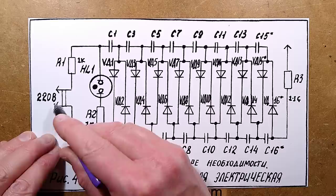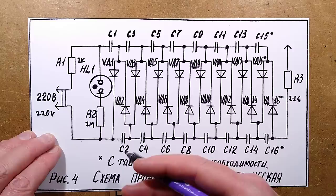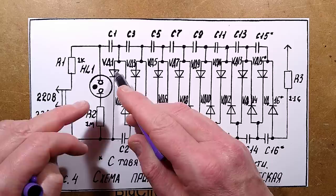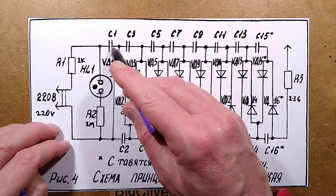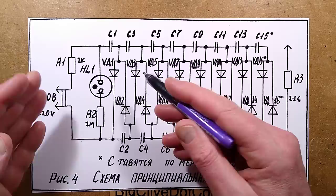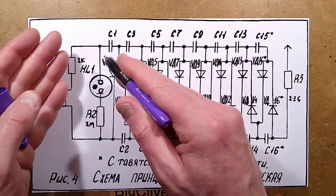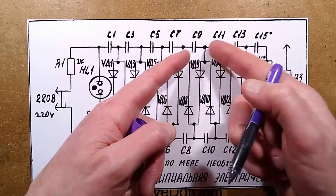So here's 220V — that means 220 volt. It does also mention it can be around 120 volt if they use a non-isolated autotransformer, so I wonder if there are multiple voltages in Russia. Fundamentally, that's the alternate push and pull of the mains — the AC. The current is steered via the diodes and it increases by one step each time. It won't double the voltage each capacitor — it adds the value of one capacitor to the next. Say for instance it was 600 volts across them once doubled — it would end up like 1,200 above the next capacitor, then 1,800. Each capacitor would only have about 600 volts across it, but it all adds up to the high voltage at the end. They claim about 4kV.